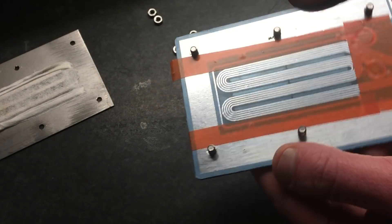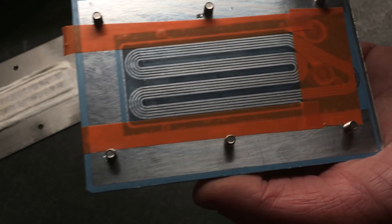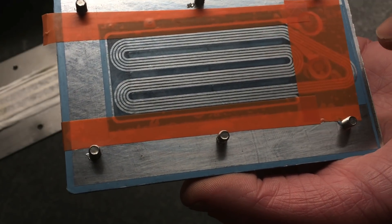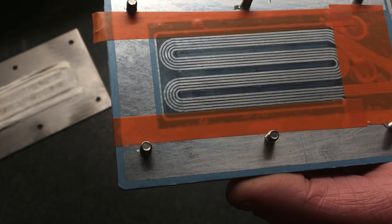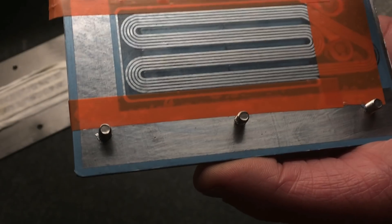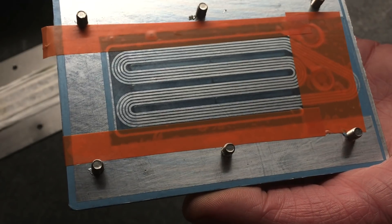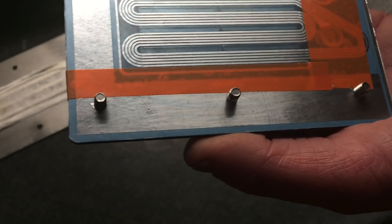I started off with this one — I'm not going to remove the orange tape at this moment. They did some weird kind of thing: the current is going like this, that's the way it's supposed to be. There are three magnets, but what they did is kind of weird — they also have one track going the opposite way. My idea — and it might actually be a really good idea — is having this one track going the opposite direction to prevent this piece of mylar from moving too much, because that's the reason there is tape right now.